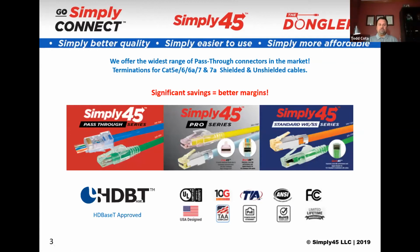Right now, as we go into Simply 45 and who we are and what we're about, we traditionally started with a pass-through connector. For those who are not familiar, I've got one kind of prepped here already, and this is an RJ45. A pass-through actually has the holes in front of the connector, which allows the untwisted wires to go all the way through.